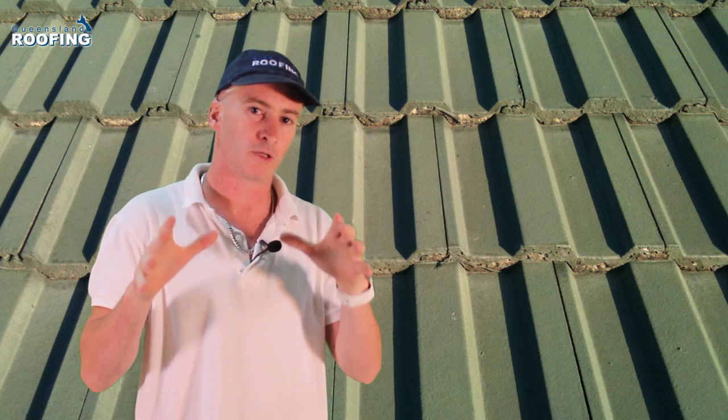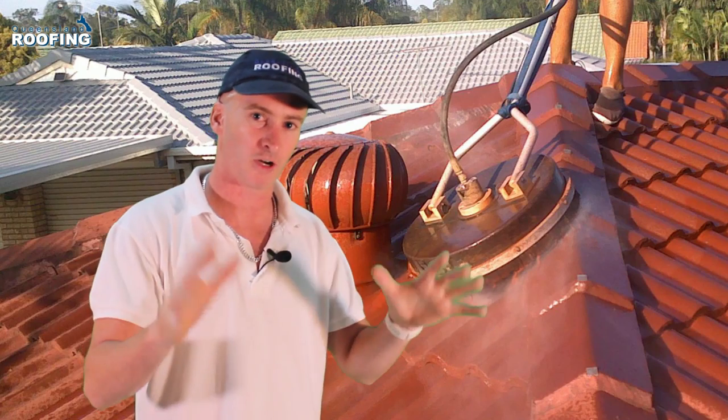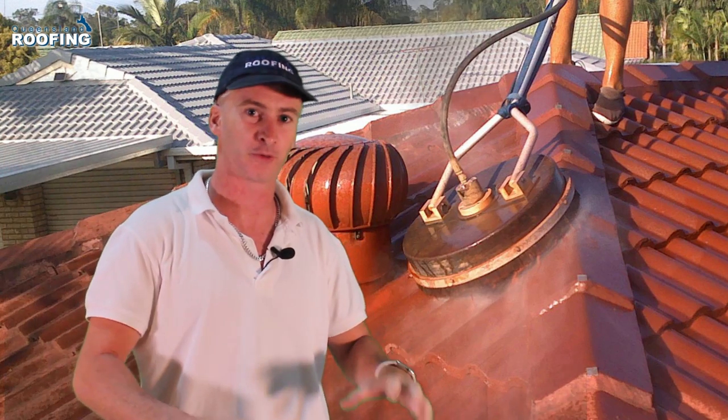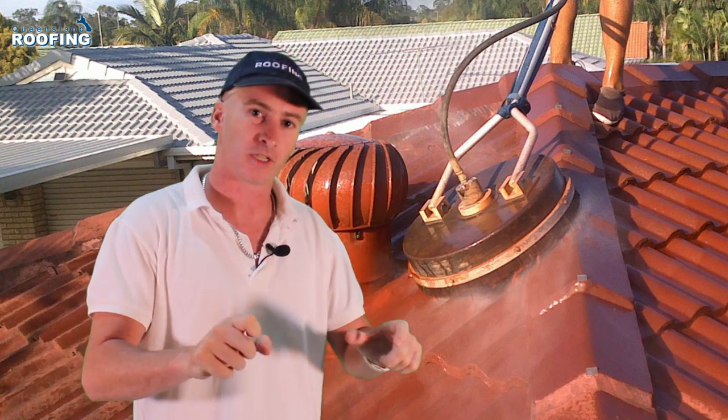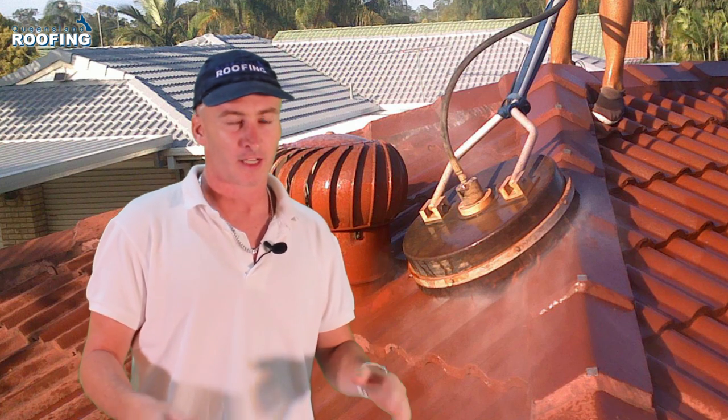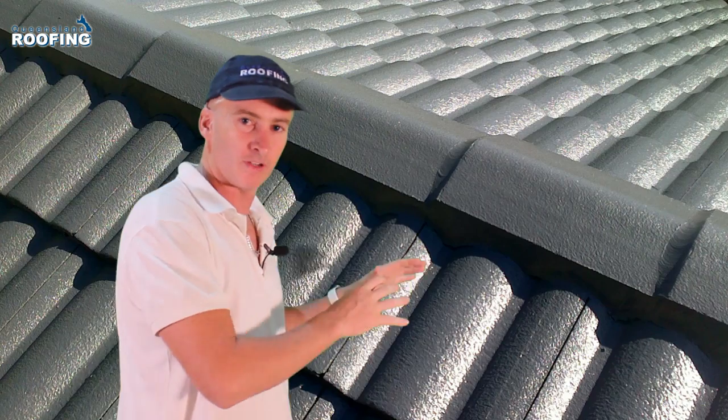Roof washing is something you must understand if you are a roofer, because if you are a roofer, you know to change your tiles first. If you don't change your tiles first, you're going to put a huge amount of pressure onto that roof while washing it — it's like four storms at once all pounding down on the roof. And if there's cracked or broken tiles, damaged watercourses, or any weakness in that roof, it's going to leak. So the most important stage in your roof restoration is the absolutely top-notch wash, and before you do that wash, make sure all the tiles are absolutely ready or you're going to get leaks.